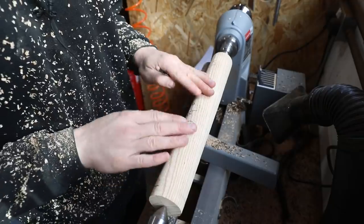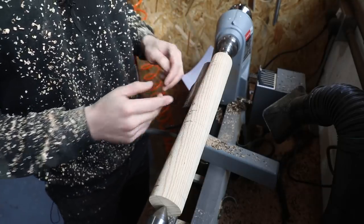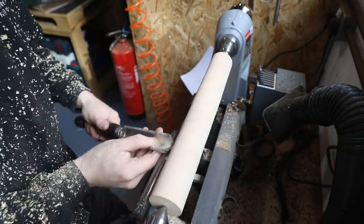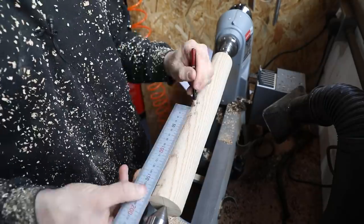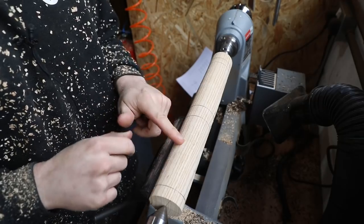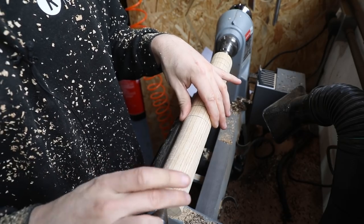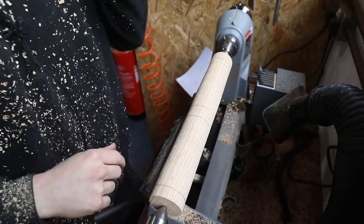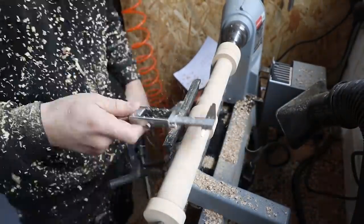So I cut this half oversized to allow myself extra room to put the details on the end, but I've ended up getting a lot more material on the end than I thought, so I'm going to scrape all this off and shift it up a bit so that I can get a larger tenon on the end here. These sections need to be 25 millimetres in diameter and these sections need to be 45 in diameter, and then there needs to be a little bit on the end and then the dome on this end.